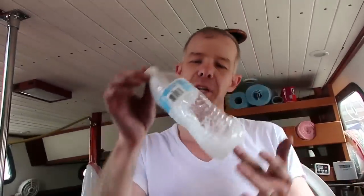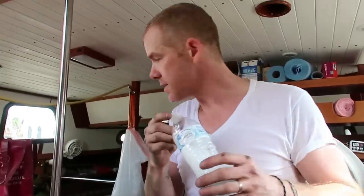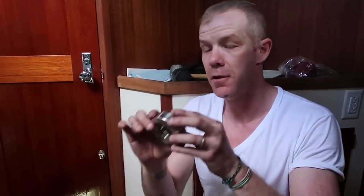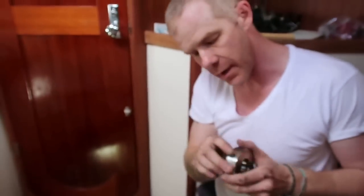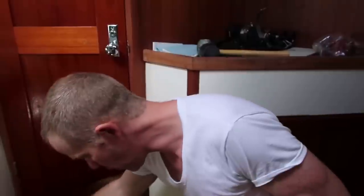It was very squeaky. All right, so we just made up a little bit of soapy water. I probably should have put some on that shaft going in there. Probably would have made it easier. But soapy water is needed to put on this little coupling part that has two very delicate O-rings that's going to be sliding over that shaft. So let's do that. This is called the rotor. Can you see those O-rings in there? Can you see that, Molly? I'm focusing. Yes. There's a couple of O-rings in there. And we're going to lubricate these with some soapy water.